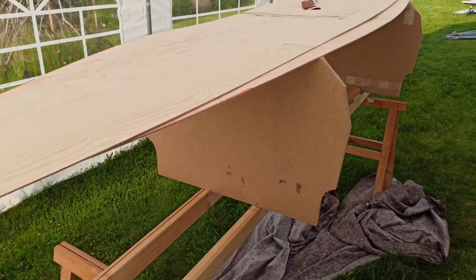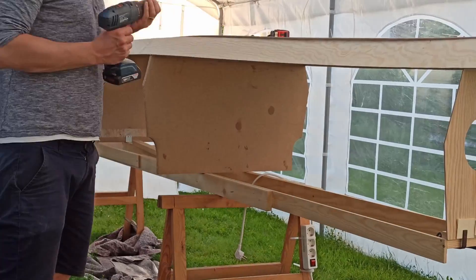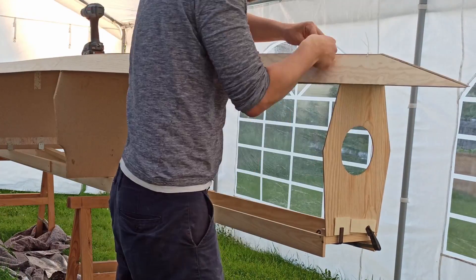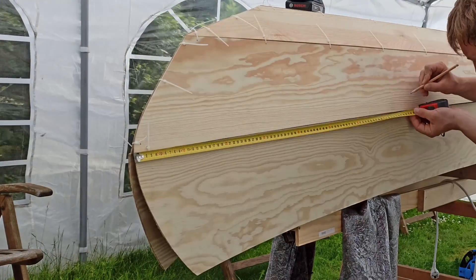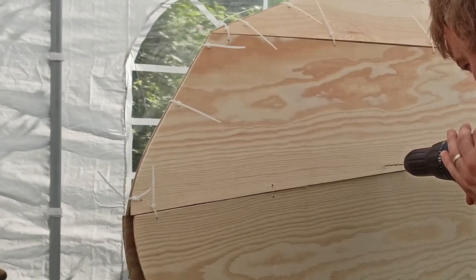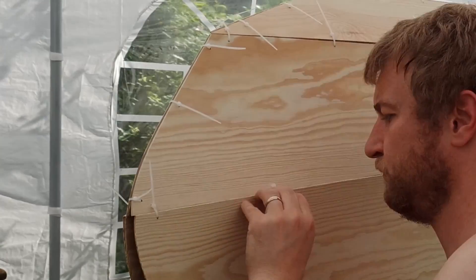Then I put the bottom plate on top of the rack. The lower plank was connected first — at the ends with zip ties and in the middle temporarily with screws that I screwed into the middle frames. The next part was drilling holes into the planks every 20cm and 1cm away from the edge. I then put zip ties into the holes to connect the parts. This way I connected all planks and afterwards I started tightening the zip ties in order to minimize the gaps, starting from the bottom plate again.